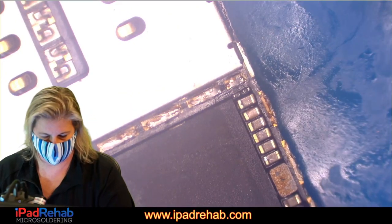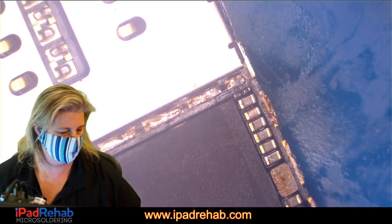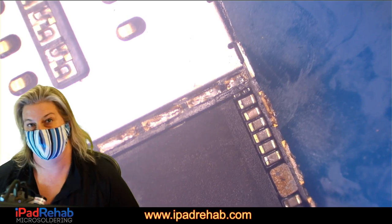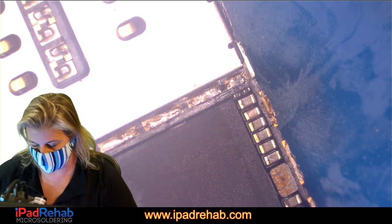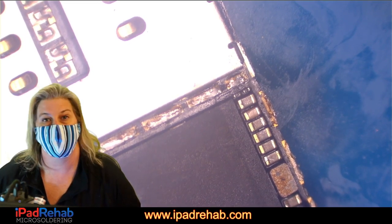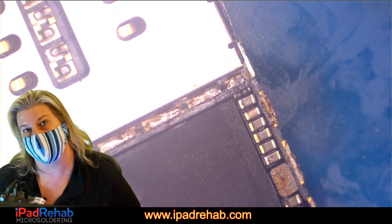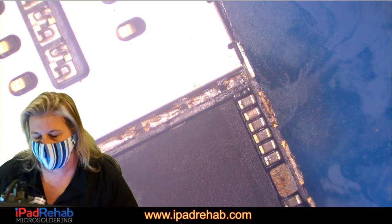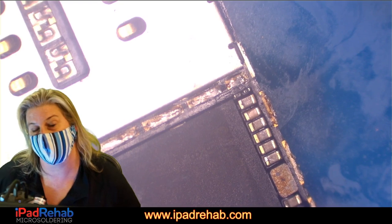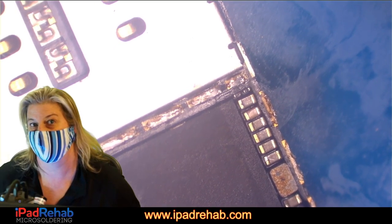I think that CPU swap, if you do it a lot, you just don't learn anything. And what we've noticed working with folks in China is that people who tend to be quick to do CPU swaps don't know anything about common failure points that are very straightforward. Once you learn something on this board, for example, these boards fail the same way again and again. So if you figure out what causes a 200 milliamp draw in a salt water damage 7+, you might have to spend a long time the first time you see that problem, but you will see it again. And if you notice on these streams, a lot of times we'll instantly say, let's check here, and see these problems very quickly. It comes from this broad experience base of seeing and spending time figuring out thousands of phones, because if you figure out a problem once, water goes the same places in every phone, then you'll know where it goes and what it does.